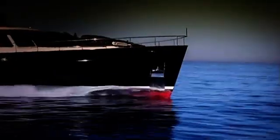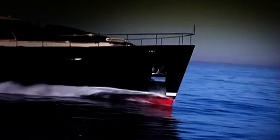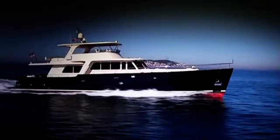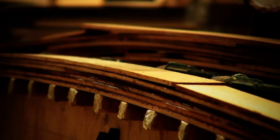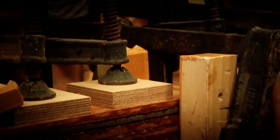Second, preventing the hull from absorbing more moisture than necessary is crucial in a wooden boat. Many woods are two or even three times stronger when dry than they are when saturated with moisture. The cold molded system aims to keep the wood dry. The epoxy soaks deep into the wood, thereby sealing it from moisture and oxygen. Keeping the water out means no swelling and no rotting, and the glued joints are firmly bonded for long periods of time.